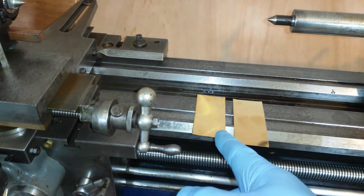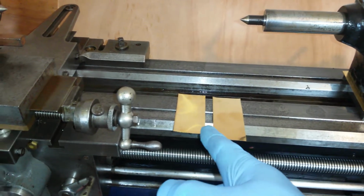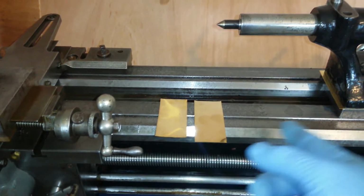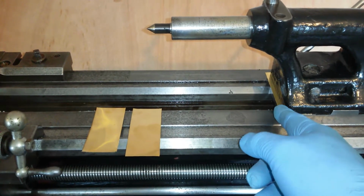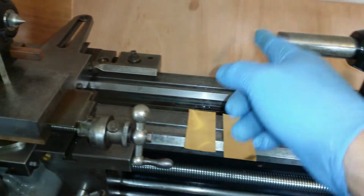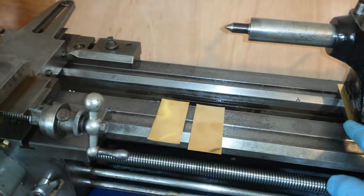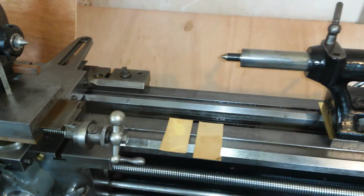So I've cut out some 450s or 460s, whatever they are. 457 they measure. Could be 460. They're 400s. For 0.4 of a mil, 0.45, 0.46 of a mil, but it did look like it needed another 5. If it ends up being half a mil, then I've got half mil shims as well. So I'm just jacking it up bit by bit.